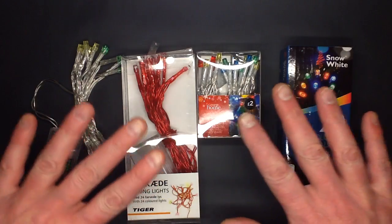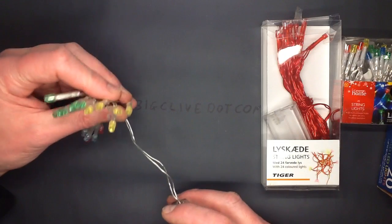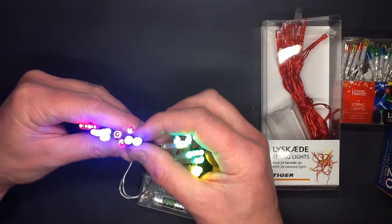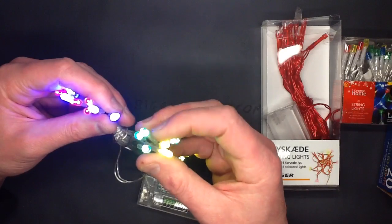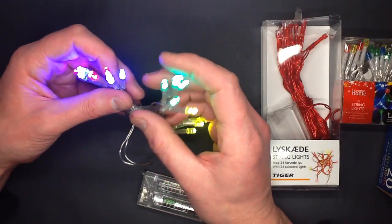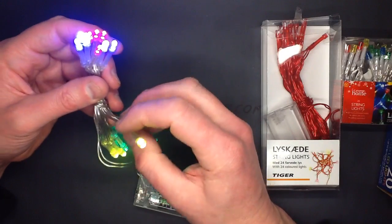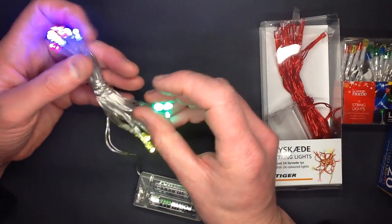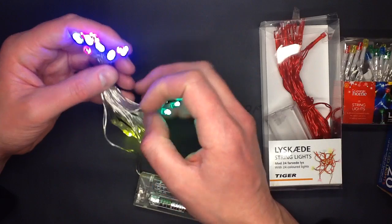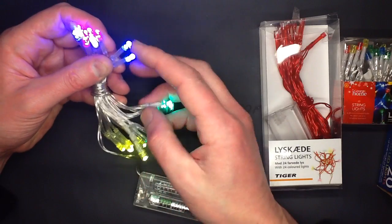I'm going to leave the auto exposure on just to deal with this, because otherwise I'd be turning the light on and off, and these tend to swamp it out a little bit. The first set - these are the Pound World ones - and it's very clear that they've used the blue chips. The green, yellow and red are blue with a phosphor on them. The big advantage of that is that the forward voltage of all the LEDs is going to be very closely matched. Because if these were standard gallium arsenide LEDs - the yellow is gallium arsenide type technology, and the green and blue were gallium nitride - then the voltages would really not be matched. You'd end up with the red and yellow ones being really bright, drawing a lot of current. Then as the battery voltage went down, the only ones that would be lit would be the red and yellow, because they'd drag the voltage below the level at which the green and blue could light.